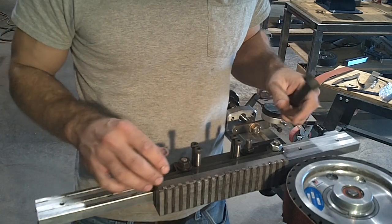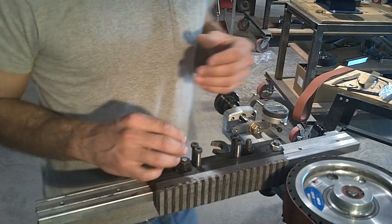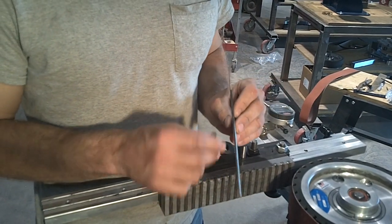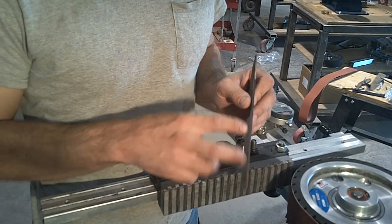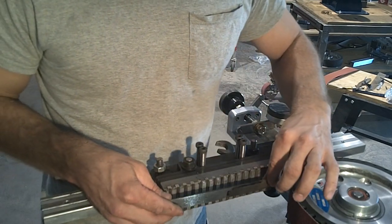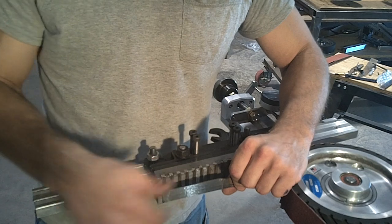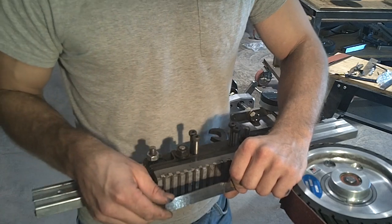Now this one is set up for two different tapers. The reason there are two different tapers is if you're going to taper a knife blade, when you taper the first side, here's one I did for another video, but I ran over 15 minutes and YouTube wouldn't let me load it. I did about 80 thousandths taper over 6 inches, so that's 40 thousandths per side. When I stick it the first way, you would run 40 thousandths taper from flat. When you flip it over, that taper would go back to level.